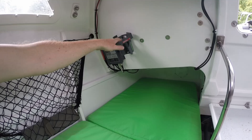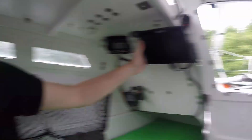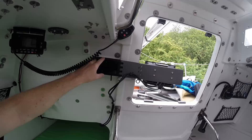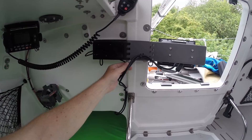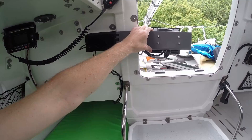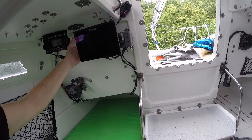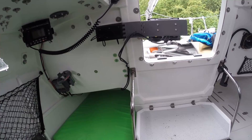Over here is the EPIRB mount — the EPIRB just sits in there, so everything you need to navigate and for emergencies is in that corner. For the GPS mount, I wanted to be able to do navigation both inside and outside, so I wanted something that would swing into place. It's just a 3D-printed block with 5mm threaded rod — the rod sits in a slot in the 3D print and you tighten it up. It's angled so it's always vertical even though the bulkhead is at 22 degrees. Pretty robust, swings out of the way — I'm pretty happy with that one.